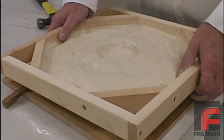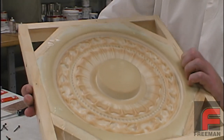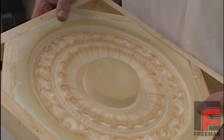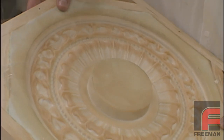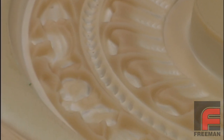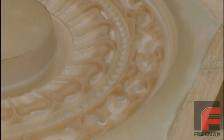On the third day, we are ready to view the results of our extra effort. You can see the differences in color between the 1035 and 1035T. Notice how the 1035 is predominant in the areas where air entrapment occurred in our earlier mold. Our new mold is virtually defect-free, making the added working time worthwhile.